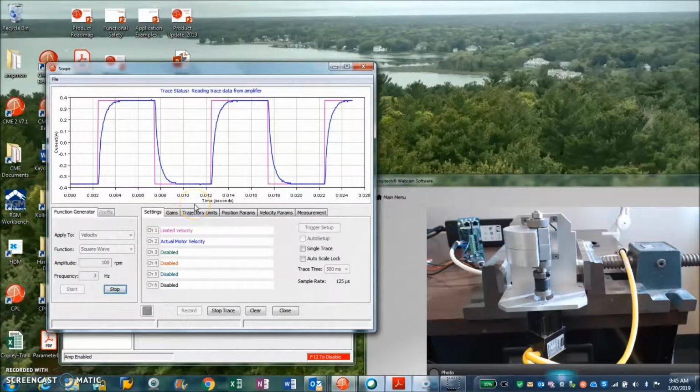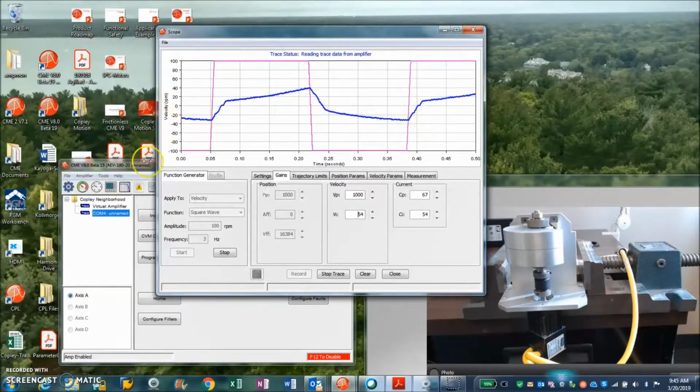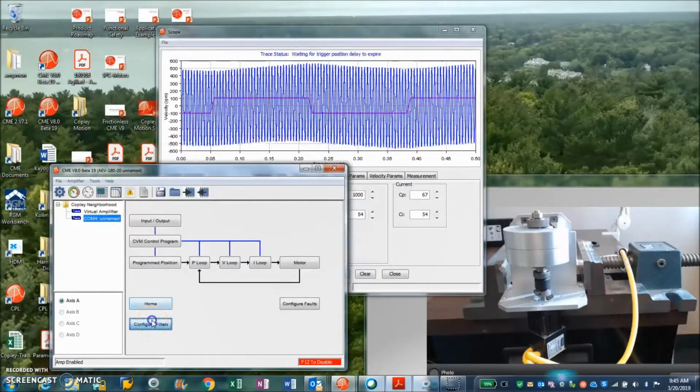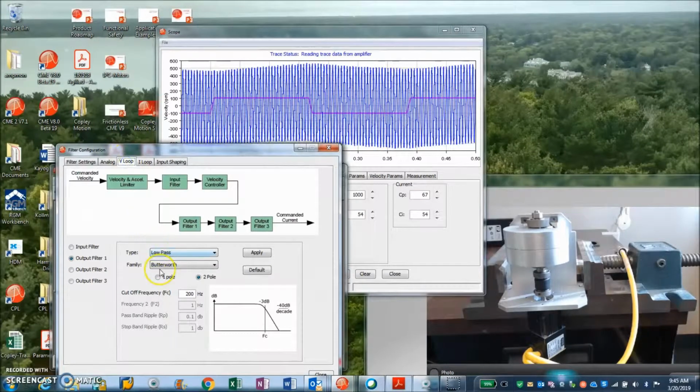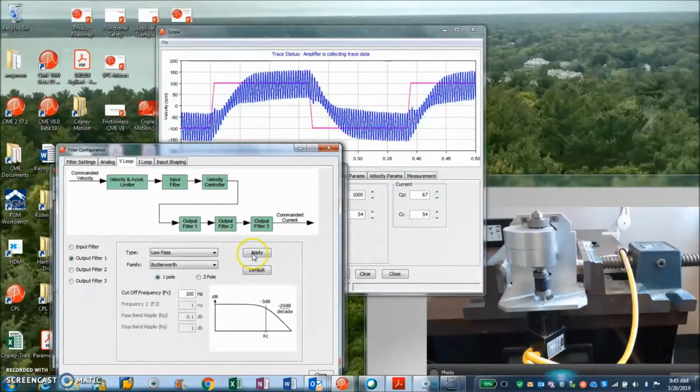So it needs some gain, okay? So I'm going to double the gain here until I break into oscillations, and we'll start seeing some motion here. There we go. Now the gain's too high normally, but with a large inertia, what we need to do is change the pole. It still gives us a high frequency. I'm going to pull it in.